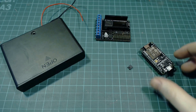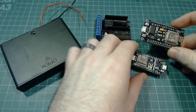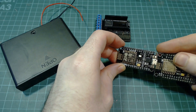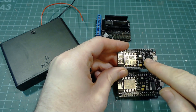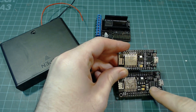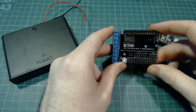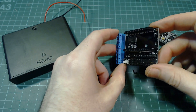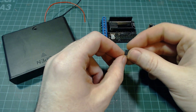For the electronics part of the project we only need the following. We need an ESP8266 NodeMCU board. These come in a couple of different sizes, so it's important to get the one that's the CP2102 version. You can tell these apart by the small square beside the micro USB port versus the longer rectangle of the bigger board. Next we need a NodeMCU motor shield. This is a really handy board because you can just drop the NodeMCU into it and it exposes terminals for controlling two DC motors.